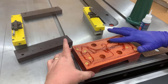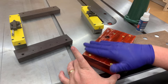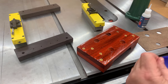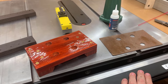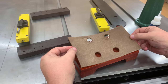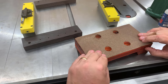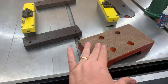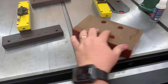I'm kind of getting tired of putting the CA glue on slowly, so obviously the best way to put this stuff on is to just get involved. Now CA can burn you, so if you were to try something like this, you're probably going to want to double glove and get your hands out of that glove within a few seconds. But I've done that — I've got a nice even coat. On the cork rubber, I'm going to spray the accelerator, and that way when I bring these two into contact, I've got to be real careful to get them perfect because they're going to set almost immediately. Then I'm just going to go around the perimeter and trim off any little bit that squeezed out with a knife.